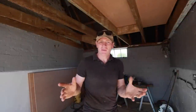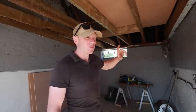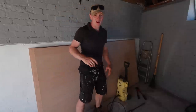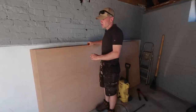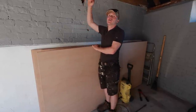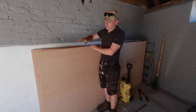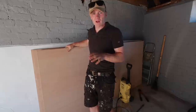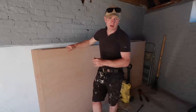We've got a bit sidetracked for two weeks but nothing much has changed. I'm going to get on and finish this ceiling today, hopefully with a bit of help. This is just regular hardwood Chinese ply - it should sit flat and smooth enough. So if we get these painted I can then just climb up on top and screw them down to the joists and the white will be nice and bright. We're going to use just 50-50 contract emulsion and water to see if that will leave a bit of the grain showing through.